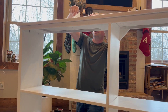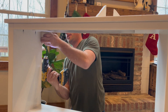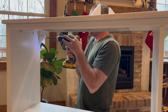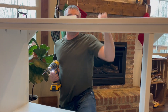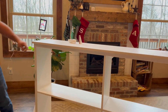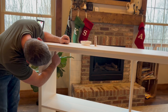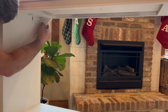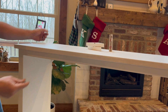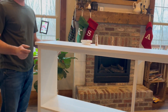Now we're moving to the left side — so it's L top, going right in the corner here. You can complete the rest of these the same way — they'll be labeled just like the others but with an L on them. The last step after you get everything secured is I recommend fastening it to the wall because of the height of the piece. I'm going to use some drywall anchors and screws. There's a hole right here — push the screw through, leave a mark on the wall, then pull it back and install the anchors. Then come up here with the screws on both sides on these top braces and screw it to the wall to make it nice and secure.